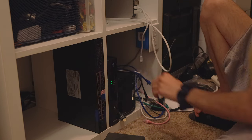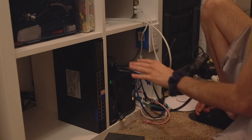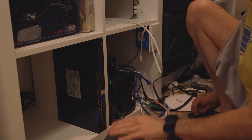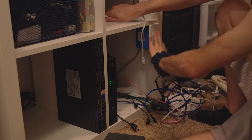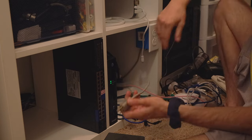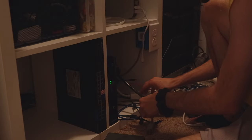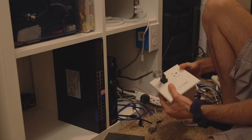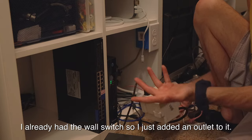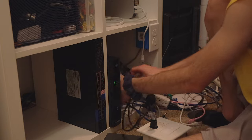I have my two DMX lines, my AT&T gateway, a POE injector in this rack cube area, and that POE injector powers the ONT out in the living room using one of TP-Link's POE extractors. I also have my little Synology down here. I put in two outlets here so I didn't have a power strip dangling in my closet — just terminated to regular Edison, cut open an IEC cable for the wiring. I also have a little smart light switch — an in-wall smart switch attached to a plug because I just needed another smart switch.